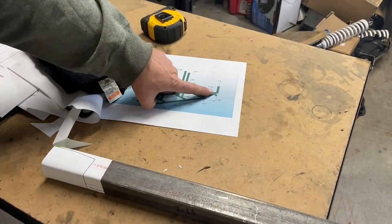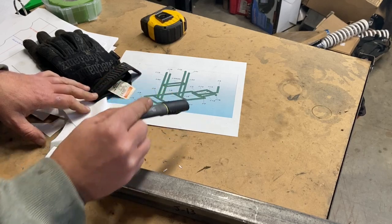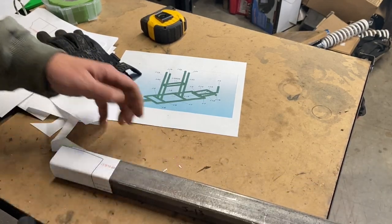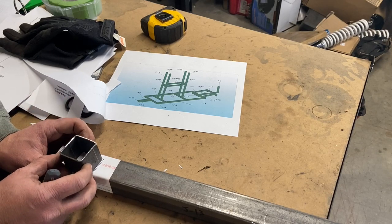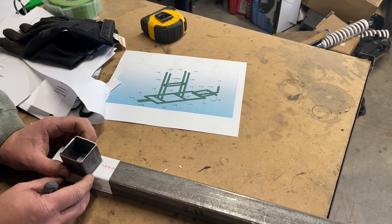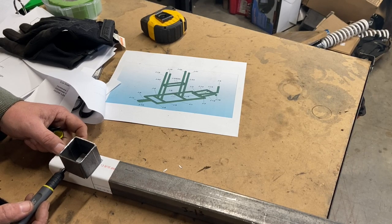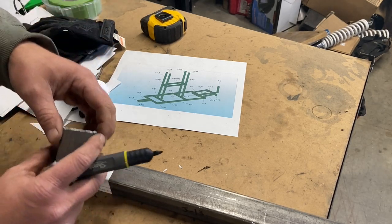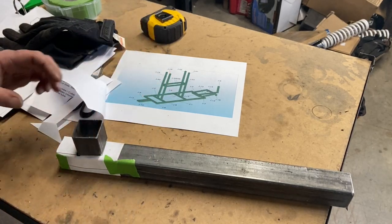These front two pieces that are at an angle are your caster angles, and it's built into these front blocks. We have to notch this so it goes around the tube — that's what makes it easier to assemble. There are notch wrappers you put on there, and the plan shows you cutting the whole thing, which will still work. But you can also take a piece of tube, line it up at that matched angle, see where it breaks, draw a line around that, and notch it around another piece instead of having a big wide open gap. It works fine either way — it's a little cleaner if you do this.